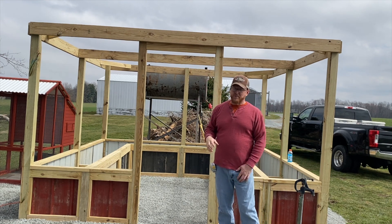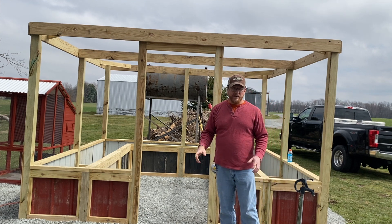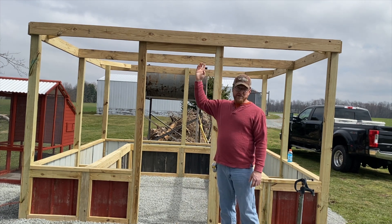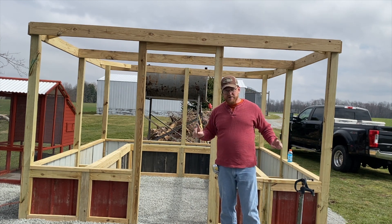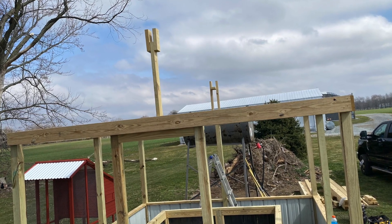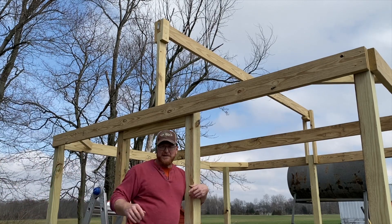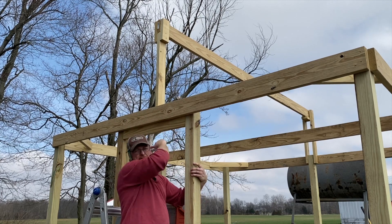Now we're ready for a roof and sides. With the lower framing done, we're going to start on the roof structure, beginning with what's called a ridge beam or ridge pole. We'll take a two-by-six, 12 feet long, running end to end, and create a structure to hold it in the center. Then we'll work the rafters off of each part. The ridge pole is installed and ready for rafters on either end.